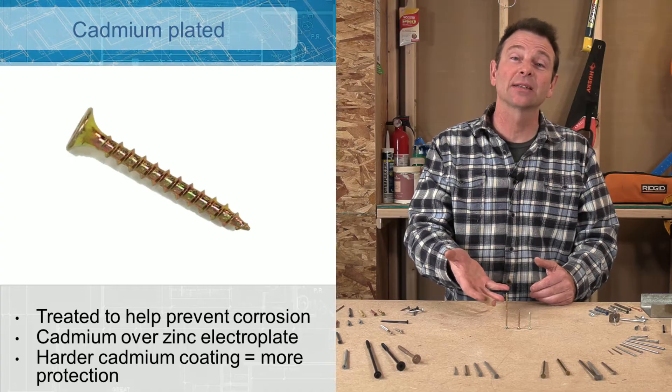You might find that your hot dip galvanize feels almost greasy to the touch — that's a product of the way it has to be added to the fastener. What this means is that when you go to drive some of these hot dip galvanized fasteners, the head of your hammer might tend to slip off of them. People will curse a lot of box nails because they're typically hot dip galvanized and the head is very hard — they're very hard to drive, especially with that thinner shank. You can also hot dip galvanize screws, and that greasy feel comes into play, so if you have a Phillips head screw that's hot dip galvanized, you might struggle to drive that screw.